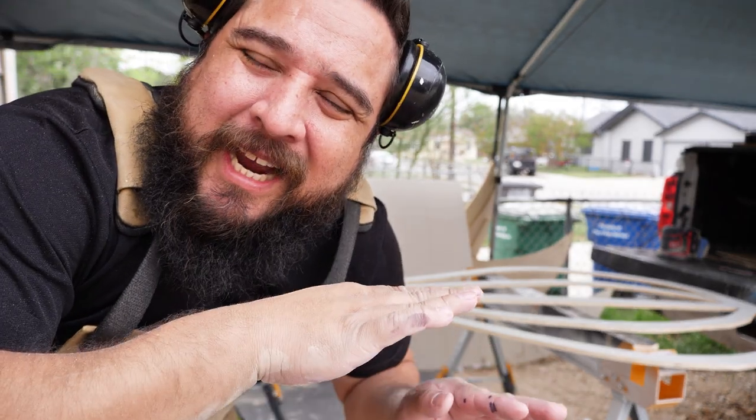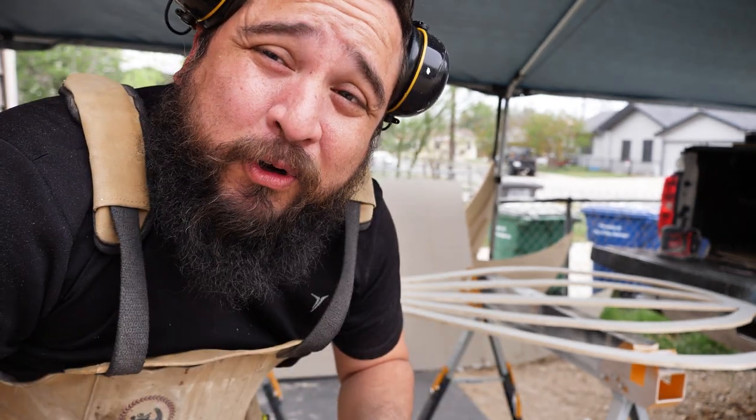That's an orbital sander. All I'm doing is giving a little round over on all the edges of all the cuts. What that does is hide a lot of the edges that you may see. That round over actually hides them pretty well. So I went through the whole thing, front and back, and did that.